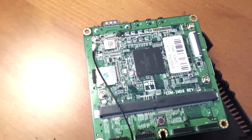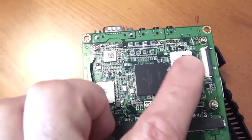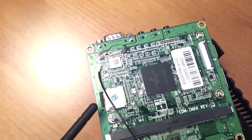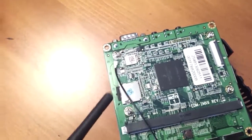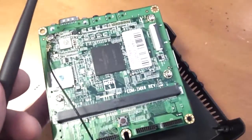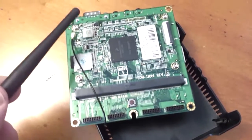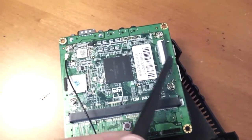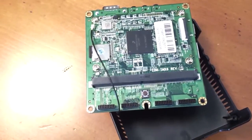This is the main processor chip. Over here is the SD card that the SOM module boots from — that's in addition to the SD card on the carrier board below. Up in this corner is the Broadcom Wi-Fi and Bluetooth module. And there's the camera I was talking about. Underneath this label is where the memory is. Very compact — here are the headers for expansion, and all the LCD connections are on here.